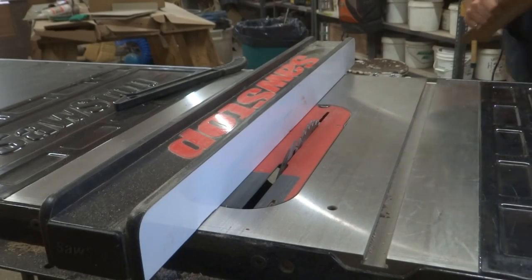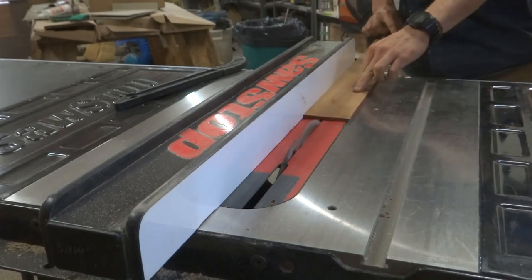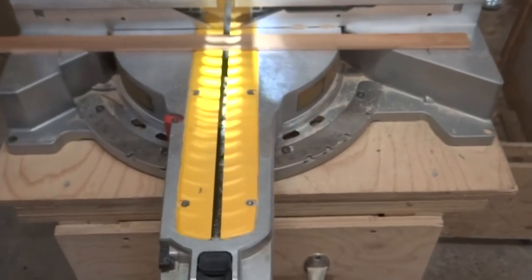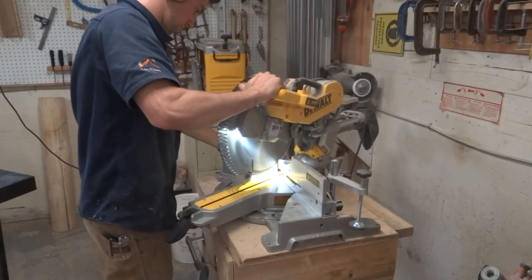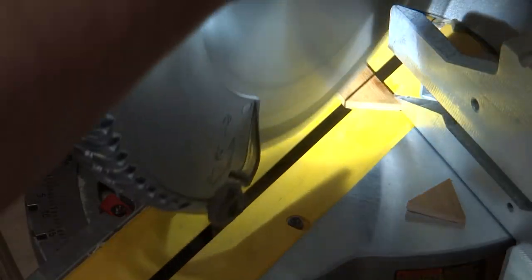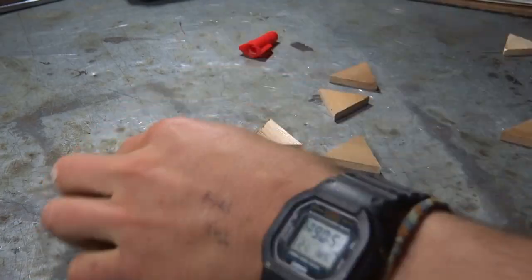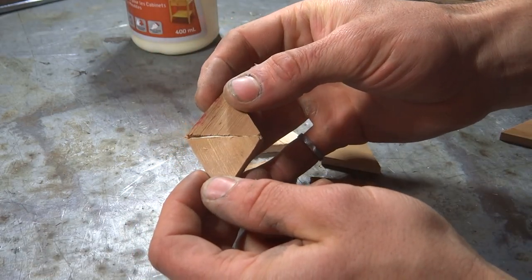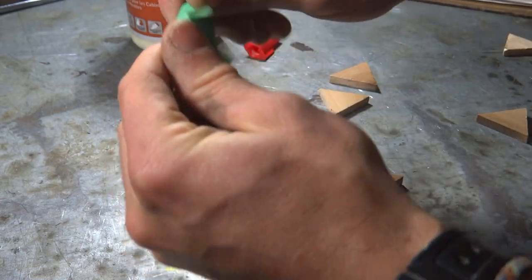Before I started cutting any leather I made a wooden template for the repeating diamond shapes. I started by ripping a piece of scrap cedar to width on the table saw. I just chose this width by eye based on the size of the purse I had in my head. I then set the miter saw to 60 degrees and cut a bunch of equilateral triangles from the strip. Gluing these triangles together gave me diamonds with 60 degree and 120 degree interior angles — equilateral diamonds — and the point is you can use this shape to make a repeating pattern.